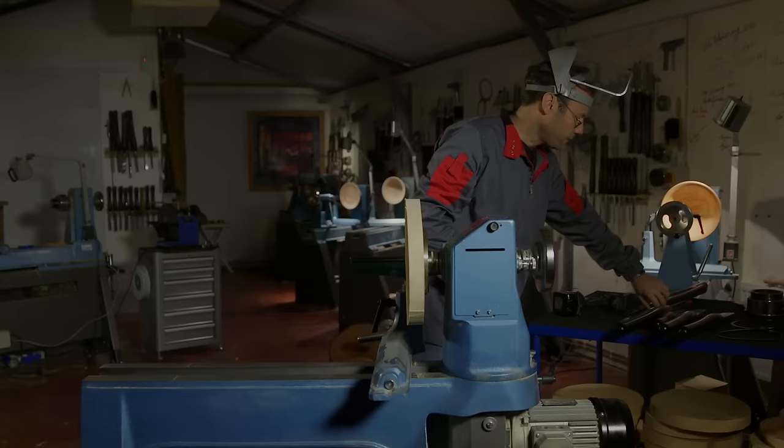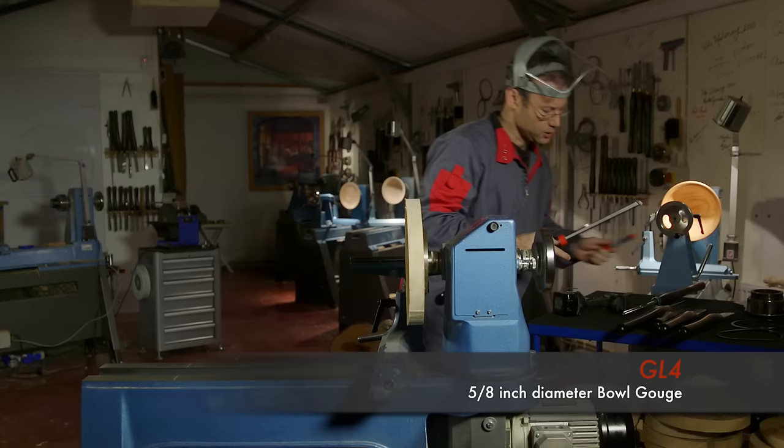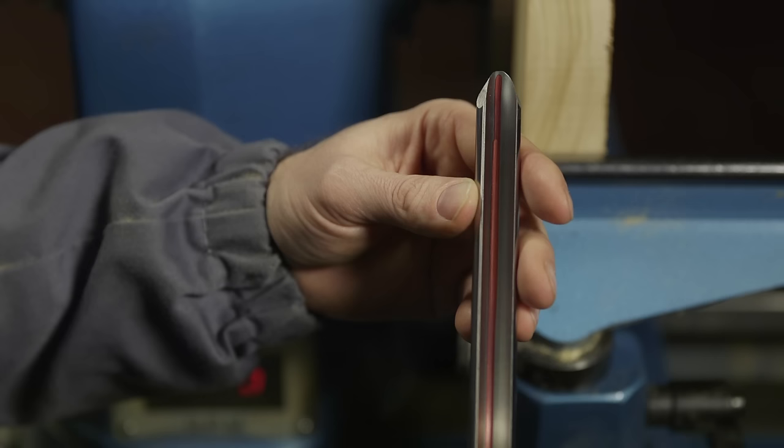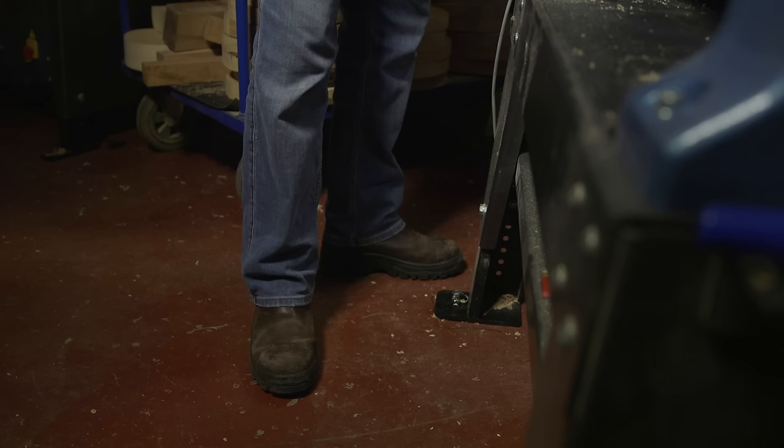So I'm going to show you first of all some of the tools that we're going to work with. The first tool we're going to use is the GL4, and what I've done is I've placed a red marker — this red line — down the center of the tool, right down the flute. That red marker is very helpful when it comes to explaining how to hold this tool safely, as it's likely to just bite in and catch. So I'm going to rotate it until the red line is gone — that's the safe place to hold this tool.